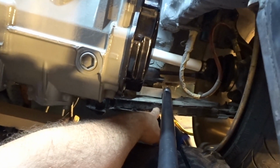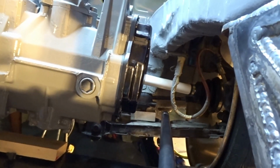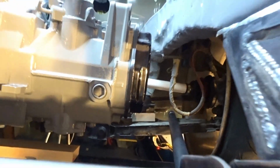I can go to the front of the A-arm, I can go to the back of the A-arm. When I go to the back of the A-arm, my bar is now longer, which makes the rate of change as that bar moves, the distance that's going to pull in and out, less. So the difference between having a short bar and a long bar is huge. The longest bar you can get in here, the better the car is going to react to the traction bars.